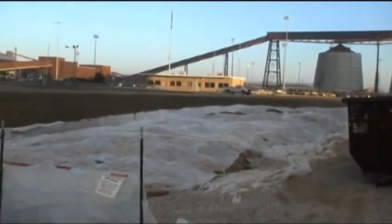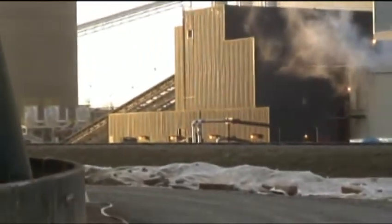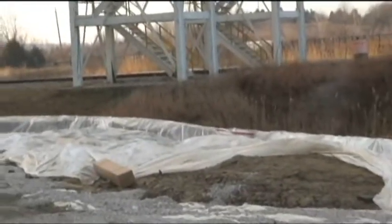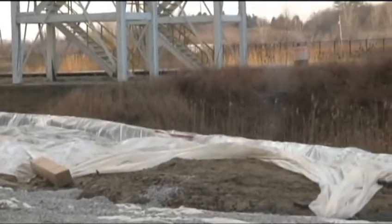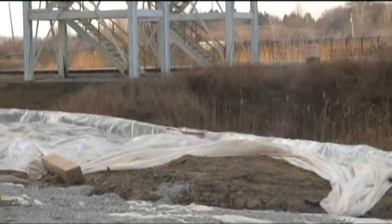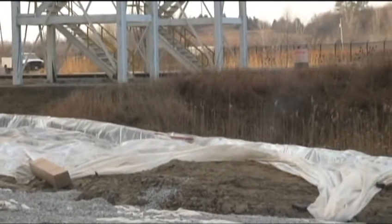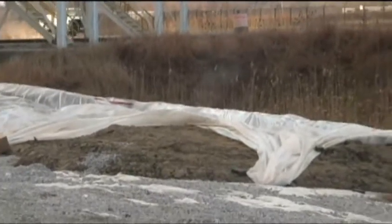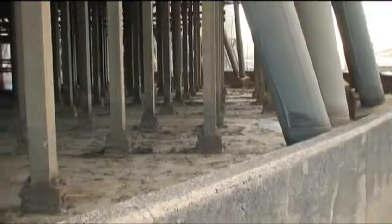Got our silt laydown area. All this silt was brought out of the basin. Second decanting area. Estimated about 4,000 cubic yards of asbestos contaminated silt material currently covered in polyfilm, to be loaded to TVA's landfill after its moisture content is reduced so that it can be landfilled properly.